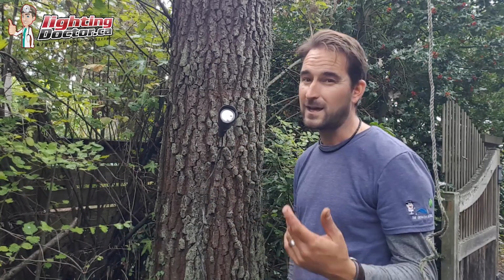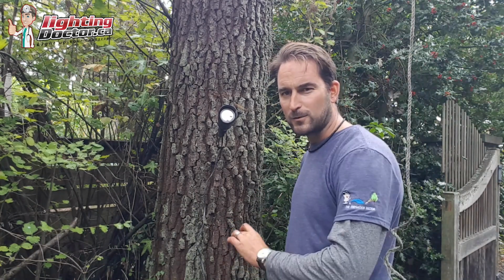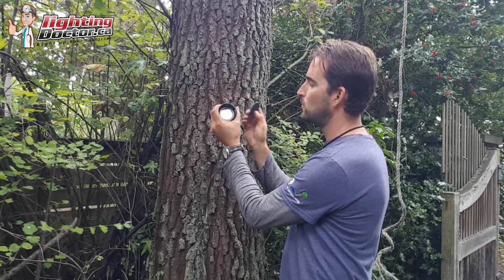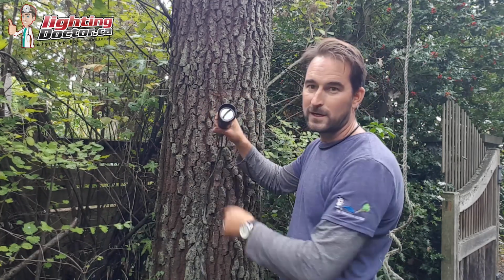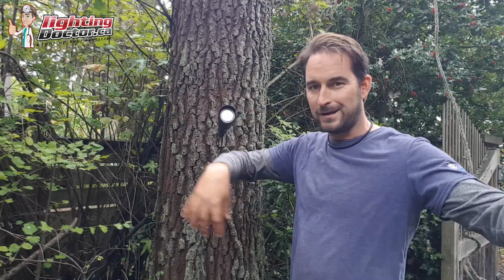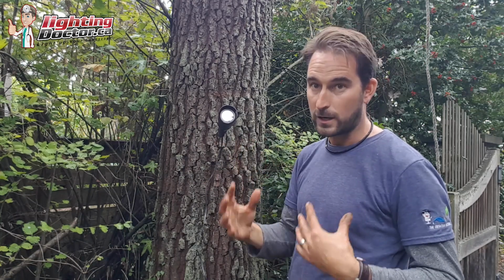One thing I will say is anytime you're doing downlighting, something you do want to do is get one of these hex baffles. I don't know if you can see this little honeycomb. Sorry, this bee's bugging me here. This little honeycomb shaped filter basically goes underneath the lens. And then now, when that's shining down, it helps deflect the glare, because especially with downlights that are shining down, if you walk right under it or in the proximity of it, sometimes it's shining right in your eye. What this does is it helps deflect that a little bit, so it's not as bright in your eye.